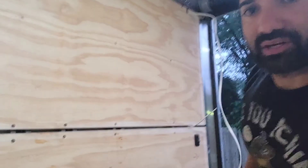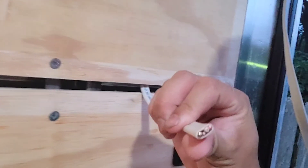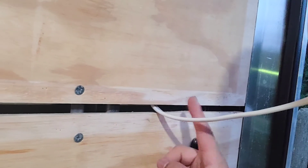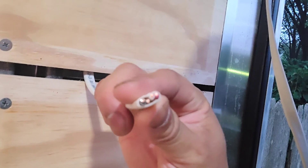That's how you do it right here — you cut this hole right up top, just a small little notch, and then you bring it down in here and you're able to fish the wire right through. Then you have all your wires that you need: your power, which is your black, and then you might have an extra one which is your red — because I'm not putting switches on this side, I did that to my first trailer but I'm not going to do it to this one. Then you have your ground and then the white one, which is your neutral.